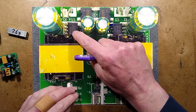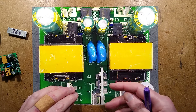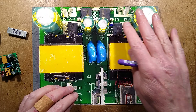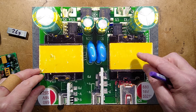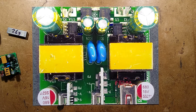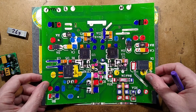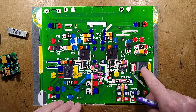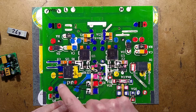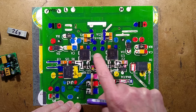The chip is an SDC5091T - I drew a blank on that. It's a very simple chip with only a few connections; maybe you guys will have more luck finding it. On the output side, one section has a Schottky diode as the secondary-side rectifier. The other side has a synchronous rectifier, and then there are two opto-isolators.